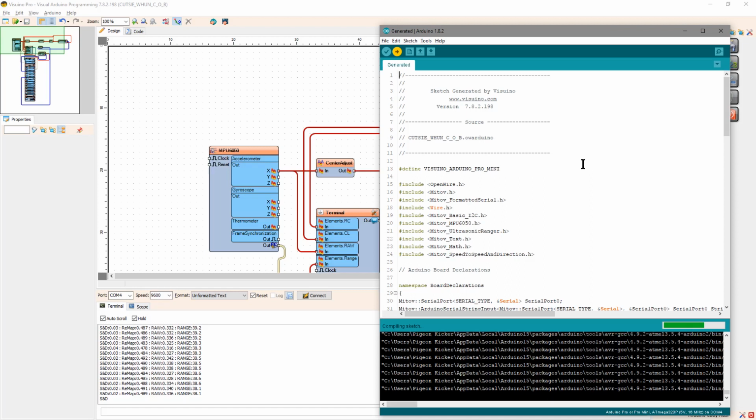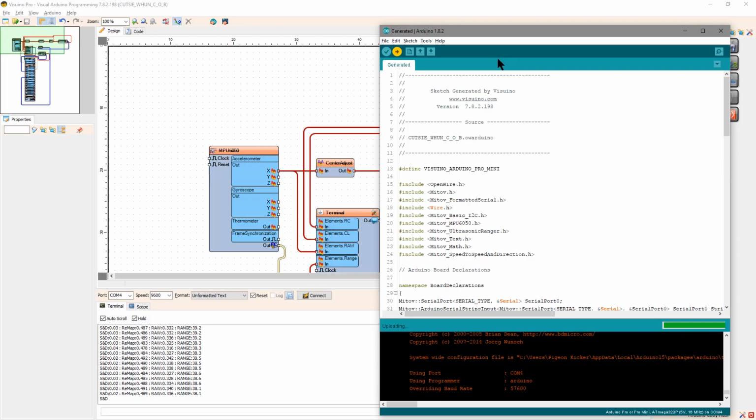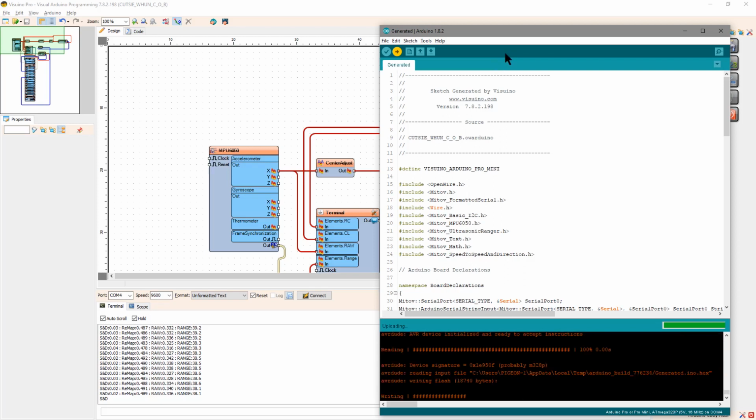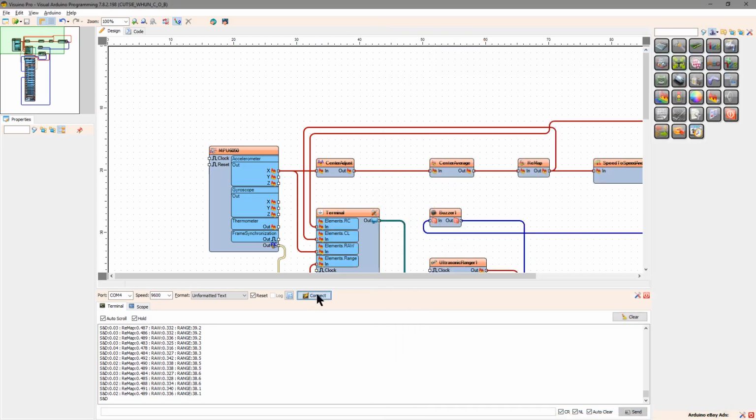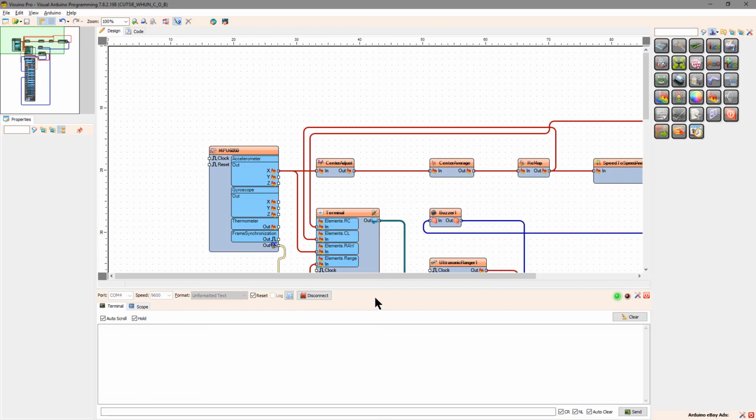And that Kalman filter would just keep speeding up and speeding up and speeding up, and it would just keep going until it was maxed out on the motors, and then the thing would lock up because I couldn't get the center point right. Now, by getting the center adjustment and subtracting that value directly from the accelerometer, you're getting a good base signal, and you can clean it up from there with filters after that. But let's see what we got here.